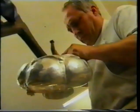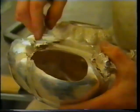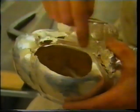The largest piece of the cup suffered the most damage, and day after day, Rod's been tapping away to give it back its shape. Yes, this was crushed in, and I've pulled this up now, and this was in as well, and there was some very heavy bruising and dents in the sides. It was too thin on one spot, and it had to be cut away. I'll have to put a piece in there. It won't be recognisable when it's done. Just look at it as it was, and then it'll be re-engraved afterwards, as all these are engraved.